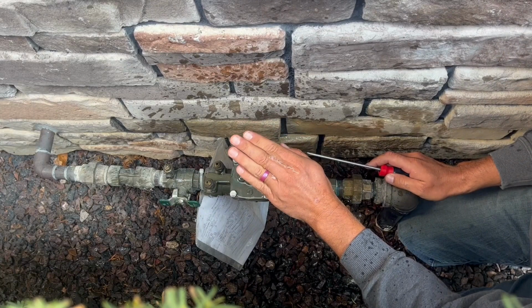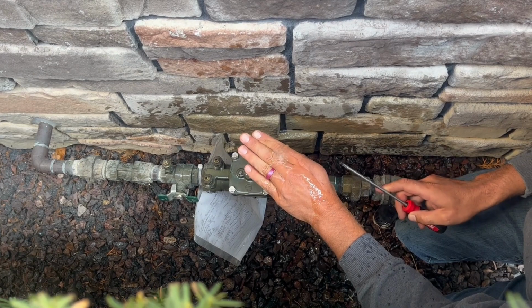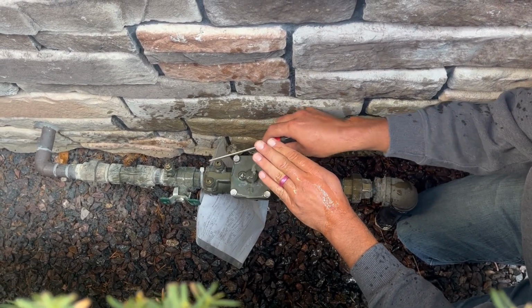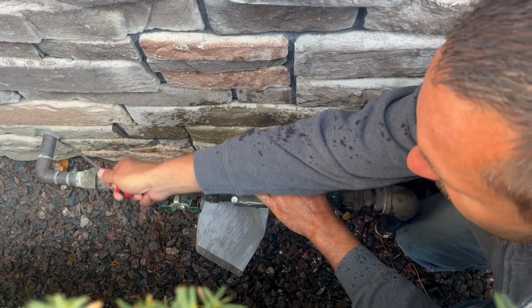Whoa. So now we'll go back down to the basement and we will back drain. By the time we get down there, this will be slowing down. And again, this is not going to get back into this side anyhow. So we'll go down to the basement and we're going to back drain the water back out, letting the water out of this part into the house.